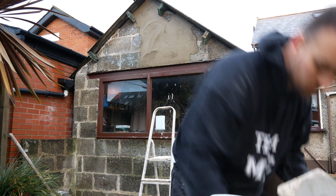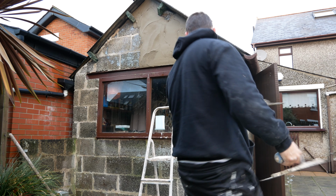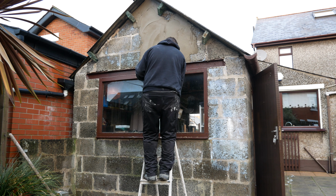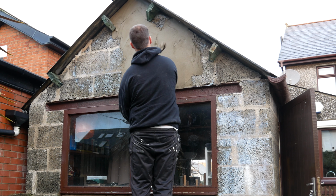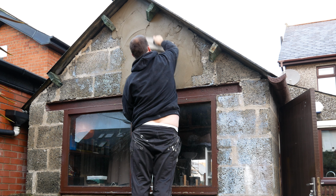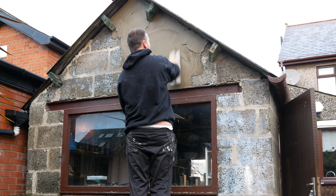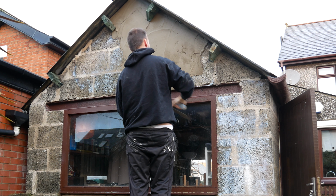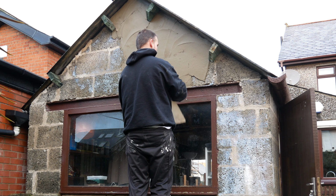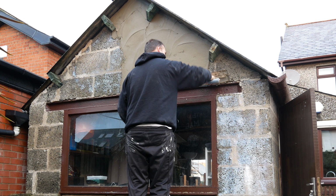So yeah, like I said, 3:1 SBR in, mortar mix in, and waterproofing, and also painting SBR on as I go. As you see, I haven't bothered painting all the bottom yet. I have a wee test on the right there just to see what way the blocks are sucking in, and as you can see, it's still pretty whitish blue colour. So the glue's not drying, it's not getting dried in, and it's pretty cold. We're in December here, so it's getting cold. Not really rendering season, but when that's the jobs you have on, that's what you have to do. You can't just sit about and wait. And again, if it's going to be dry and you have outside work, guys, and you know it's not going to be freezing temperatures, you gotta crack on, get them outsides done while you have the chance.